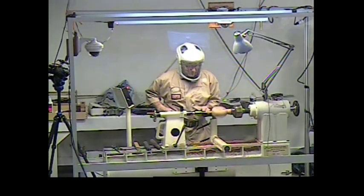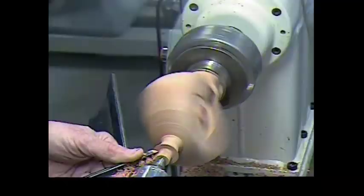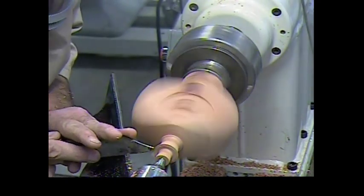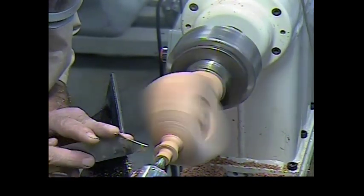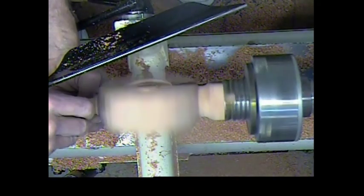We use this 40/40 grind because you can make it cut really nice and clean right there. And I'm going to work just a little bead in there. You're going to sand a radius. It's hard sanding with flat sandpaper, so make a ball or any type of rod in there to make that work.